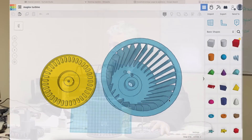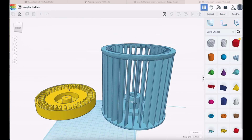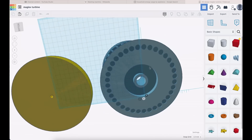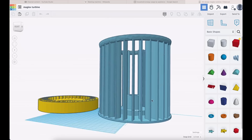This is actually just two parts. Here are the TinkerCAD drawings — basically two parts. The yellow part has the little stubby bits where the coil goes, an indentation where the magnet drops in, and a hole for the axle. The blue part is the squirrel cage turbine, with slots where the small magnets go in pointing north-south, north-south. Those are 1 millimeter by 1 centimeter magnets.